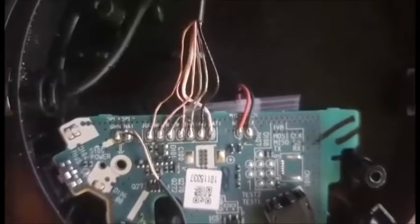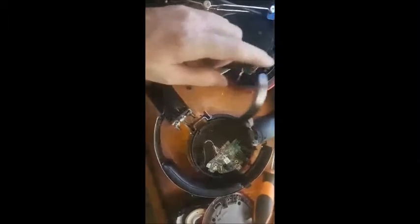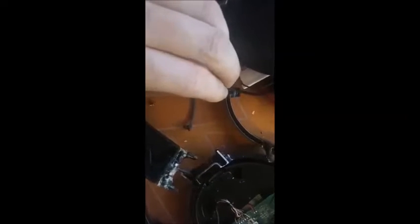Looking at the order of these wires so I can solder them back on. When getting this apart and trying to get through the curved section, there's a little plastic bit you can pull off but you need a small tiny knife or something to get around it. There's also a little metal pin that gets put in there which stops the cable from passing through - just pull it out and then the cable should come through freely.